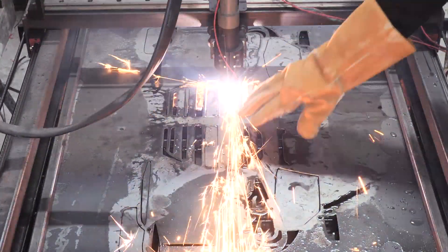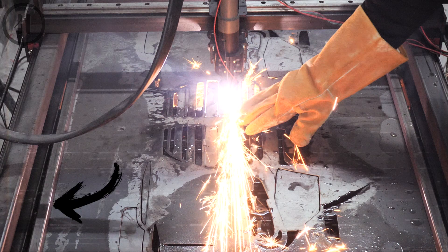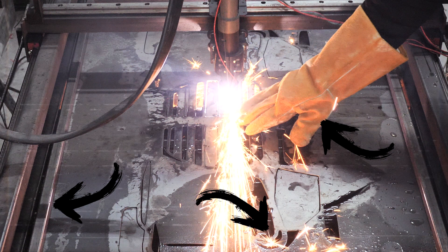And now let's just hit pause. As you can see, we've welded a frame the same dimensions as the piece we're cutting. This frame clamps to the table to keep the piece down. I am constantly standing above it and pushing the sheet down, and on top of all we are using a water pan and spraying water constantly.